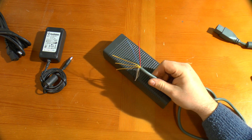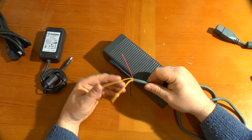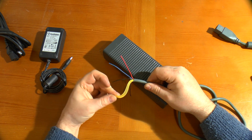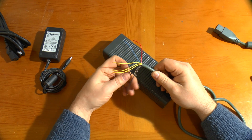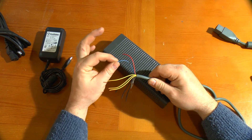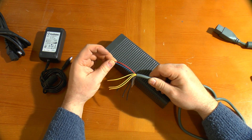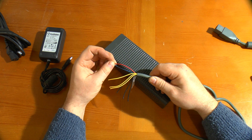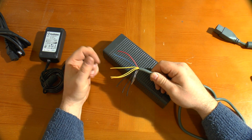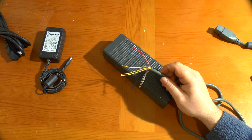Surprise surprise - a whole bunch of wires, colored the same as you'd get in a PC. The yellow ones are 12 volts, this one is 5 volts, and obviously you've got ground here as well. This is the power-on wire, which you can connect with a switch or leave it permanently connected to the red wire, and that will power up the power supply for as long as it's connected. I want some fused outputs so I'm going to put this to one side.